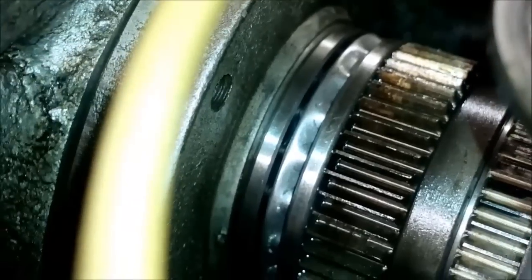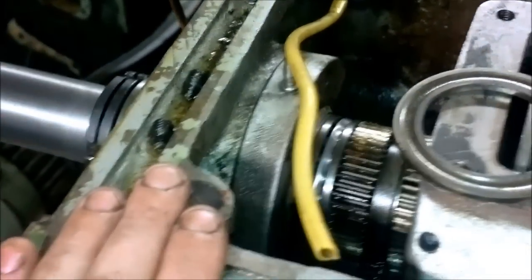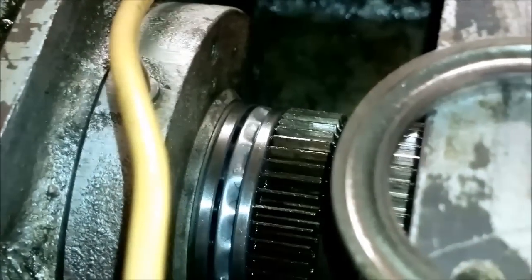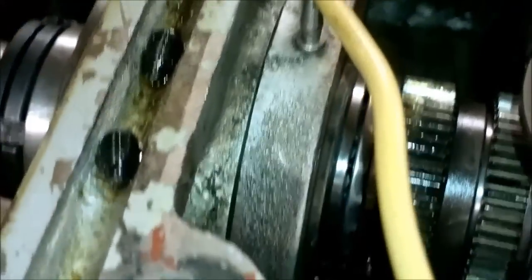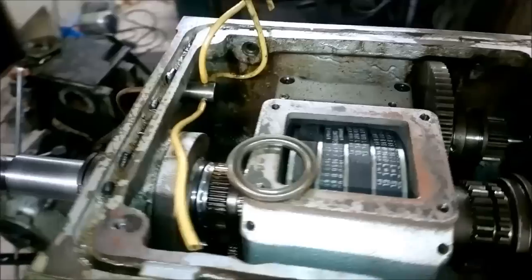Okay, I guess this is enough of the spindle, I mean the thrust bearing. Oh, one more thing. When we went to see this lathe, we took the spindle box cover off. Factory Dragon saw, after about 5 seconds of watching, that the rear bearing was gone. And actually, right away he knew what was wrong with it. He knew that it was installed the wrong way. And it took me this long to figure that out. So I guess he's pretty experienced with machines.